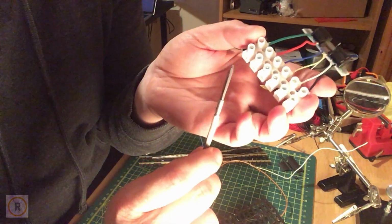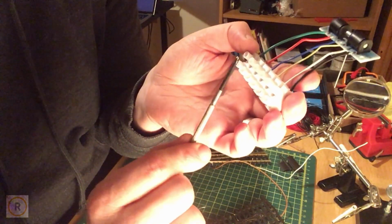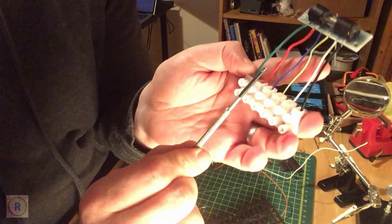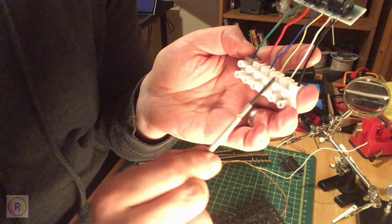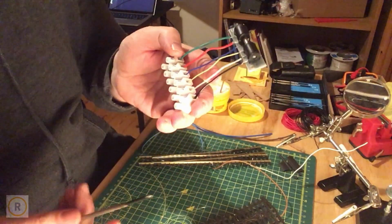You can check out my other videos on building the control panel. We're not going to worry about that today, but the point being, no pun intended, that when the power is supplied to D and E, depending on which way the point motor is switched, the polarity will come back through F, and that's what we're talking about today.